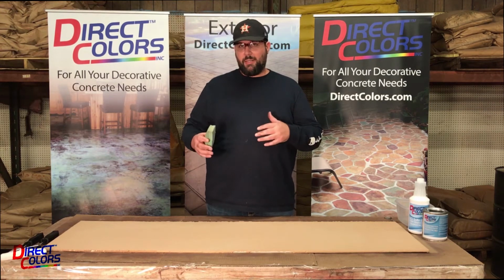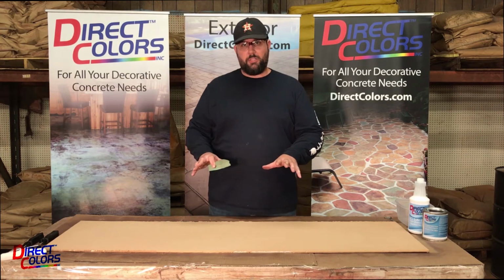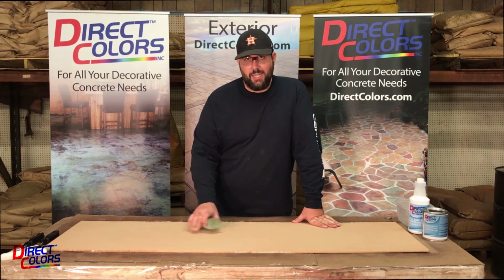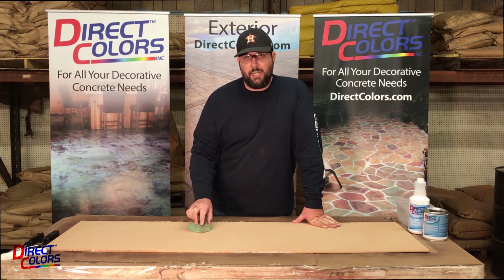Now, with a floor sander or heavier equipment, give it a little bit longer to dry, or else you'll sand through it really too quickly. But I want to show you real quick just how easy this stuff can sand. It's very hard, about a 9,000 plus PSI, but it will sand down pretty good.